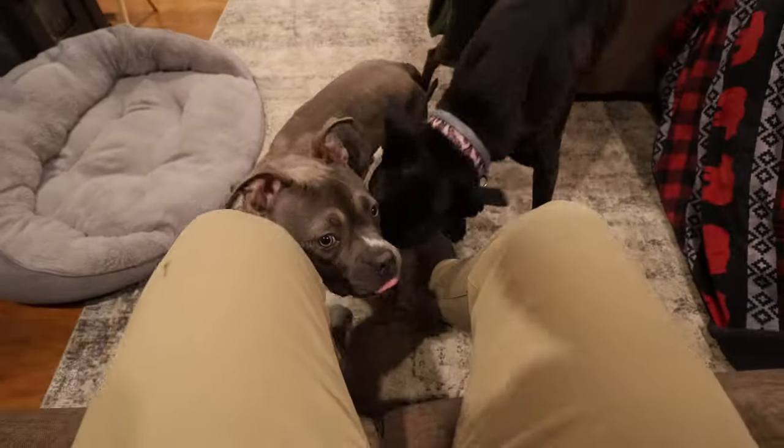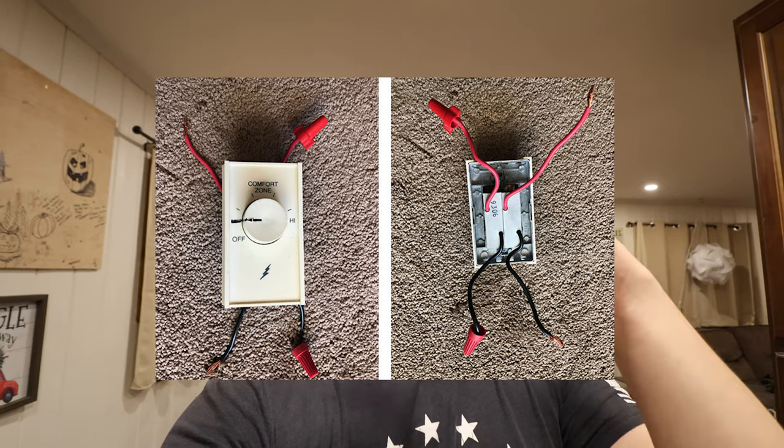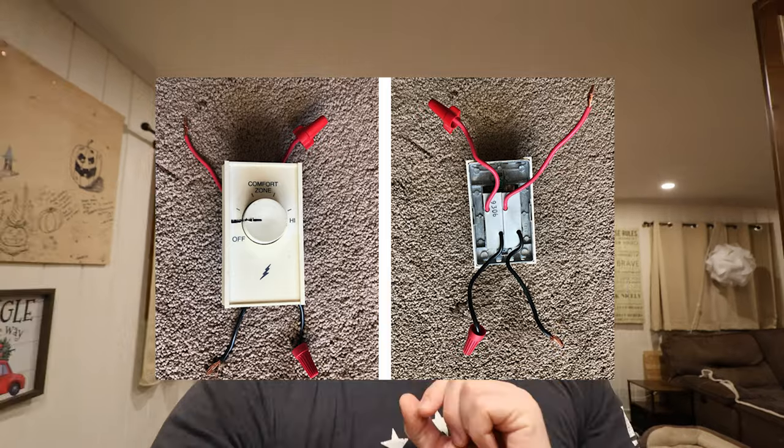Hi Freya. It's a pretty straightforward system, although it is different. When you do baseboard electric or any sort of resistive electric heaters, typically the thermostat is in line, meaning that the wire that comes from the panel goes directly into the box that has the high voltage, 120 volt to 240 volt thermostat, and then the load comes out of there to your heater.